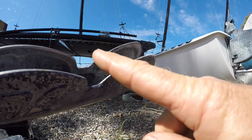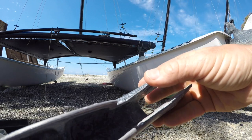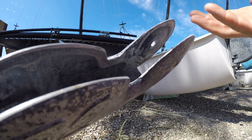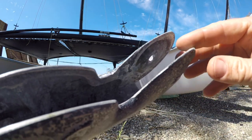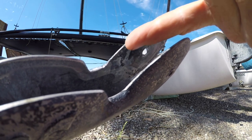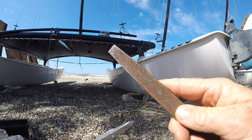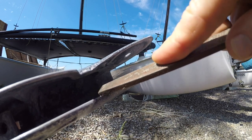These dents can push in, causing sharp bits on the inside which can cut into your rudder blade. So what you should do is perhaps once a year — as often as you take your rudder system apart, which should be at least once a year — just run your finger along the inside. If you feel any parts sticking in, take a file and just file that part of the rudder stock.